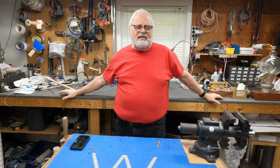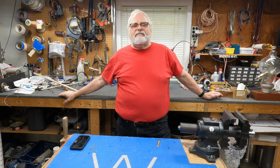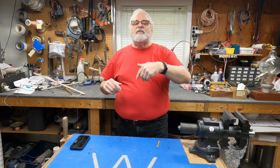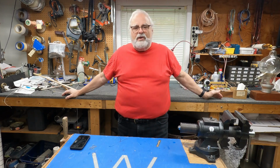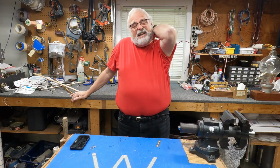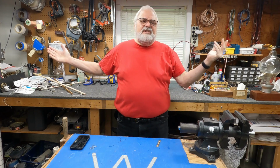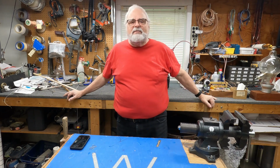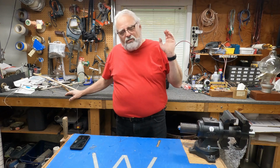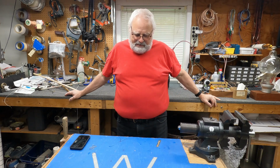But geez, you read so much about these things, you say, if there was some way I could experiment with it. So you think about 10 meters, right? So 30 feet, that's still 120 feet on a side, which makes the overall length of the antenna roughly 250 feet, let's say. That's still kind of big. And to top it all off, you need to have four supports, specifically in a location that aims this rhombic, because you can't move something 250 feet long that plants that signal right where you want it to be. So that was a little bit depressing.